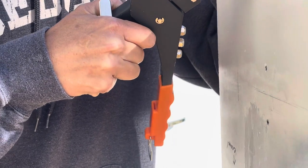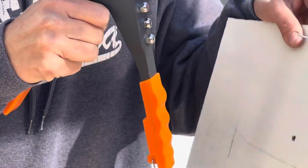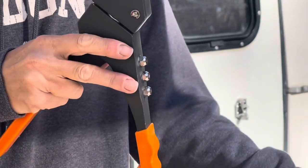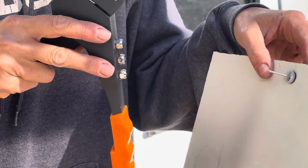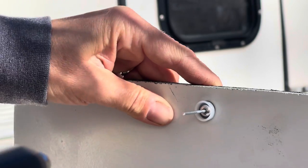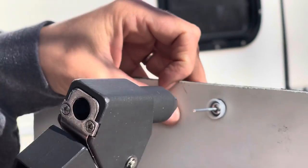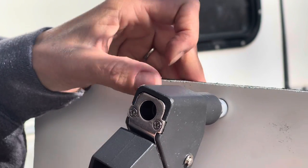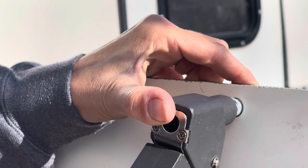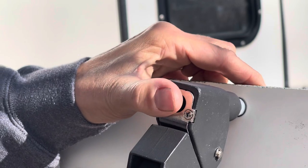If it goes in, you want it to perfectly fit — not too large, not too small. Just test them all and find the right size for your rivet. Then take your rivet gun and put it all the way flat against your rivet. This is important: if you bend it one way or the other it won't go in right.